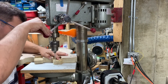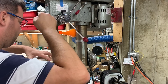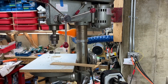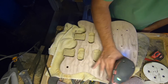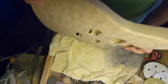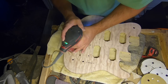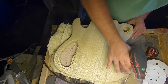We'll then drill these out with a 3/16-inch bit. Where I've got a little bit of recess I'll put a piece of wood in there so I don't get any blowout. Then sanding — did a lot of sanding here. I did that first initial sand, and then after it was all routed and done I did the final sand. I still had to sand out the bumps from the carving. I started with 80, 120, 220, and brought it all the way up to 320.